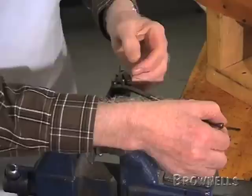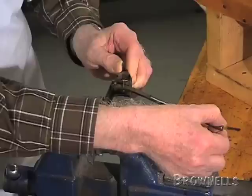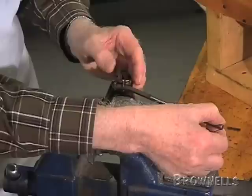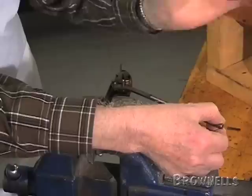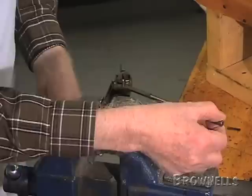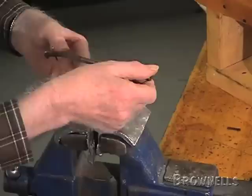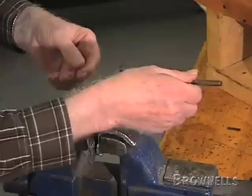Now, when you fire the gun, you lift up the sears while pulling the trigger. The hammer goes forward. It hits the firing pin, and then it rebounds very slightly off the firing pin, a matter of about a 32nd of an inch. So it kind of hits the socket and comes back a little bit. Now, I'll release this, and that lock will cock itself. It'll cock all on its own. It's cocked itself, and that's what happens when you open the gun. The lock cocks itself. So it's an ingenious little mechanism, really.